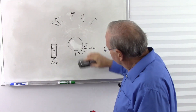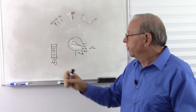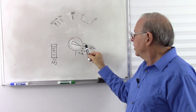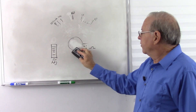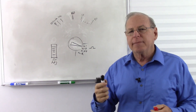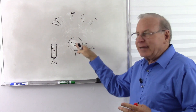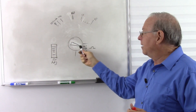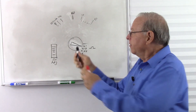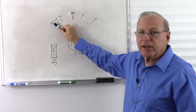So once again, we set the scale to where we want it to go — let's say times 1. Every time we change the scale, we zero it out: touch the leads together, adjust until it reads zero. Then we put our resistance in and see it goes to 50 — what would that be? Times 1, 50 times 1, that's 50 ohms. So let's go through this exercise with an unknown resistor. First we start by putting it on the times 1 range. This is somewhat backwards from when you're measuring volts or current.